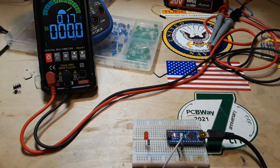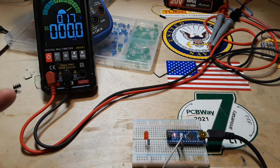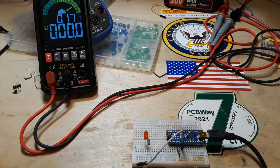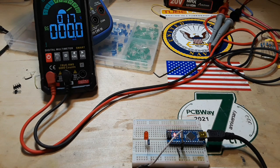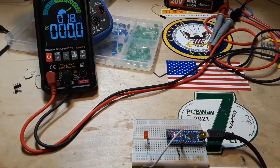You're going to find 20 milliamps is pretty bright. I like to dim that down a little bit. But also, what we have to keep in mind is the total current rating — not just of the single pin we've attached the LED to, but the overall current handling of the Arduino itself. That magic number is 40 milliamps. 40 milliamps per pin is the maximum, and you definitely shouldn't be drawing 40 milliamps per pin or eventually it's going to overheat.